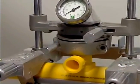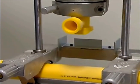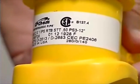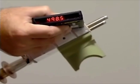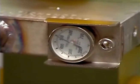Secure the fitting in the saddle application tool. Move the fitting away from the main pipe. Determine saddle fusion forces from the fitting label. Verify that the heating tool is maintaining 490 to 510 degrees Fahrenheit surface temperature.